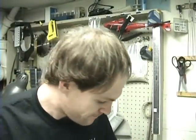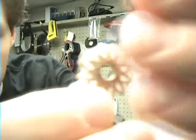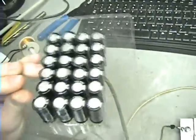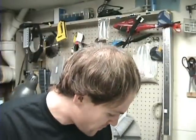It's late, I'm tired, but check this out — this is my little baby Starship coil. I made another one that's a little bit bigger so you can see the size difference. This one's actually coated in clear glue stuff and it's flexible — you can bend it. I have this capacitor bank, a bunch of photo flash capacitors: 330 volt, 120 microfarad, 24 of them. I use them for my railgun, but today I have a little mad scientist quest — shorting out that much power through a coil this small.